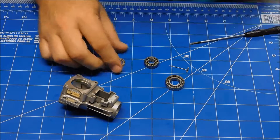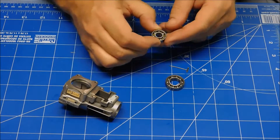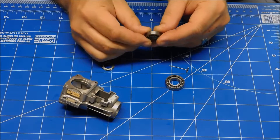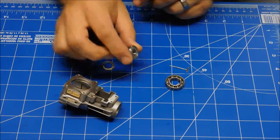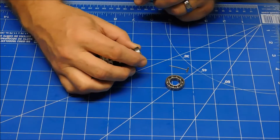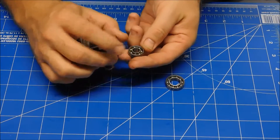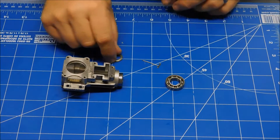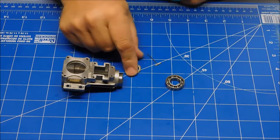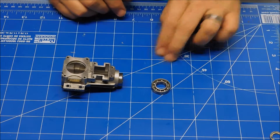Okay, so there we go — that's all there is to it. Remove that little shield and I've got an open rear, and this will be the front. This will be coming in like this so that it keeps as much oil from coming out, but any oil in there will allow these bearings to get lubricated. All you do is just pop that shield up — you just got to get in there with something sharp, deform it, and lift it out.